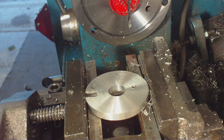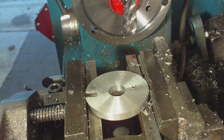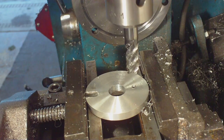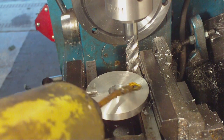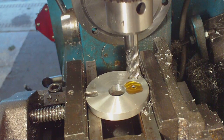Just changed the tool for the next bit, because I have got to make a little recess for the tip of the cable - or the little hook to sit into. Ready for the next bit with a 12mm roughing mill. I am just going to plop that in - we are not going to have to go in far, just about half way, to make room for this little doohickey to fit in.